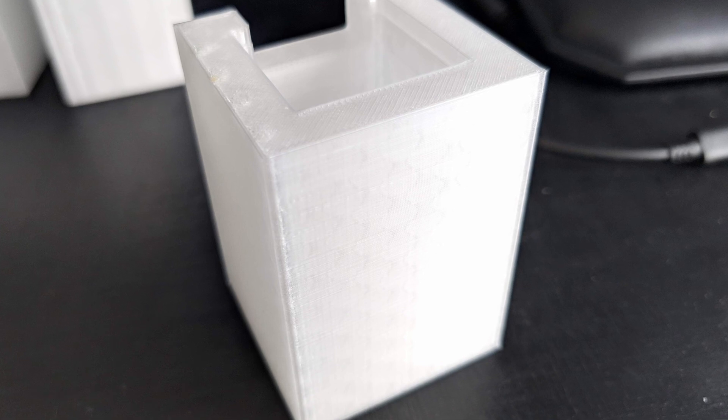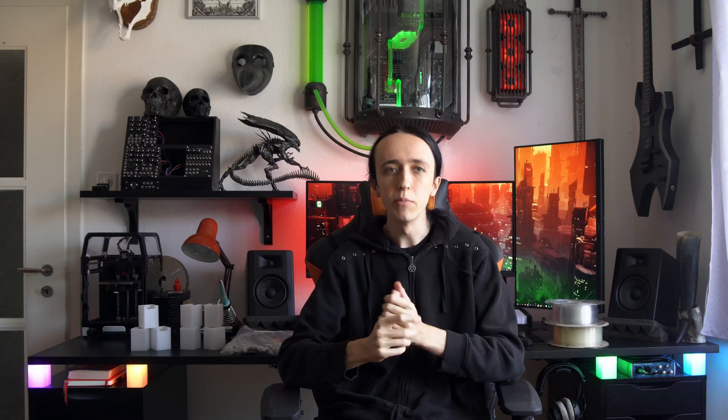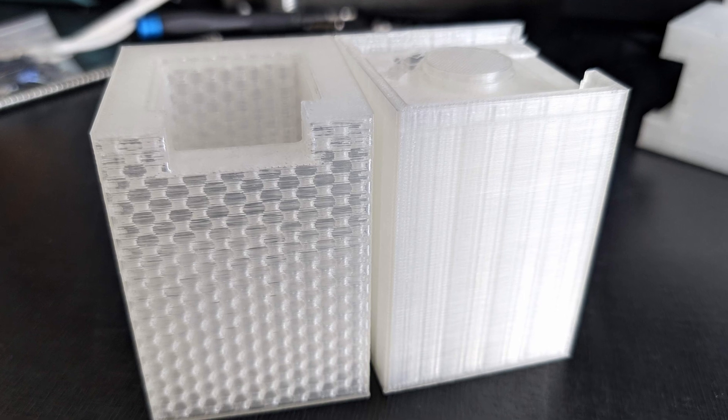Now I didn't just switch up the 3D model a bunch, I also played a lot with the slicer settings. The raw material is basically clear with just a slight tint to it, but as soon as you start 3D printing it and there are slight gaps, it becomes quite milky. This is good since I want to not be able to see the individual LEDs but have a nice even glow. But things like how many perimeters there are, what kind of infill structure, how dense the infill structure is — all of that plays a huge role. Because the material is translucent, you can also see the infill, so it needed to be very uniform and look pleasing to the eye.